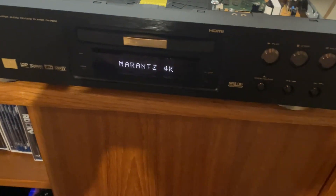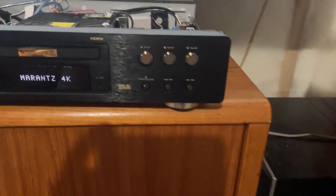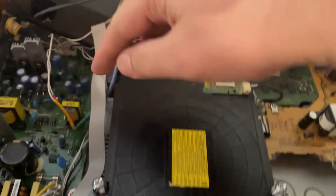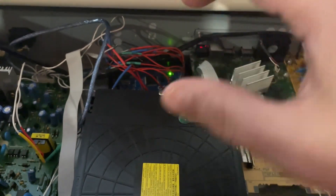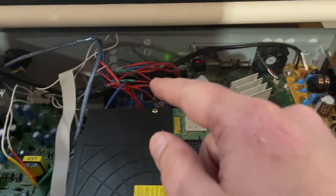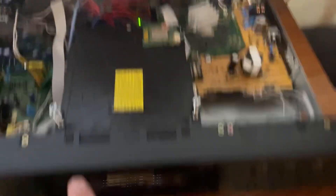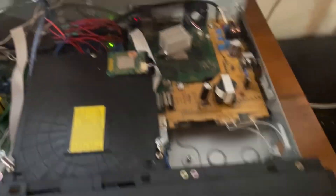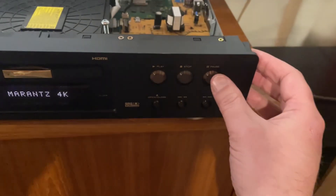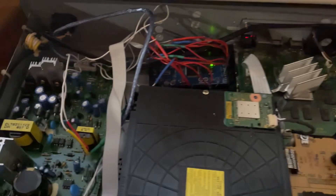There's an infrared pickup on the front panel for the remote. What I want to do — not working yet — is get the front panel transport buttons (play, pause, stop, next track) working. The front panel buttons are already wired via ribbon cable to the Arduino. The plan is to decode which button is being pressed and send out the appropriate infrared pulses into the IR input, so the front buttons effectively act as a remote control for the Panasonic board.